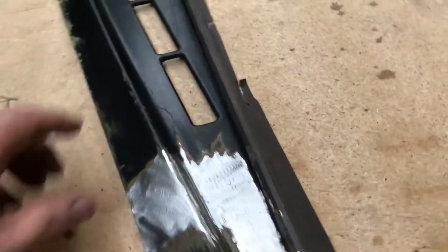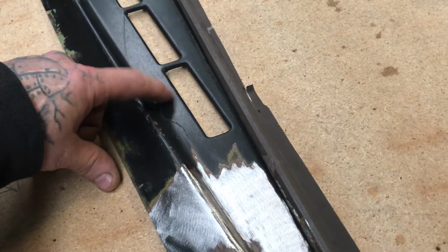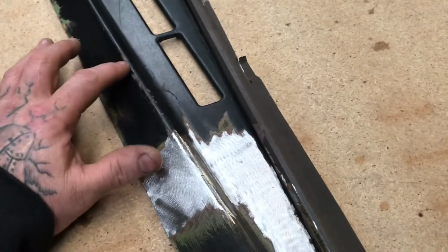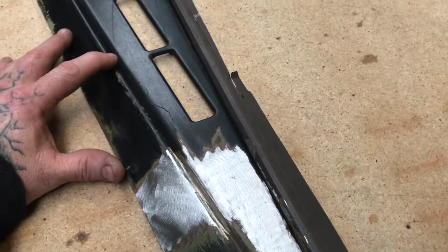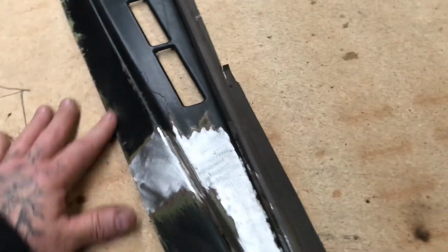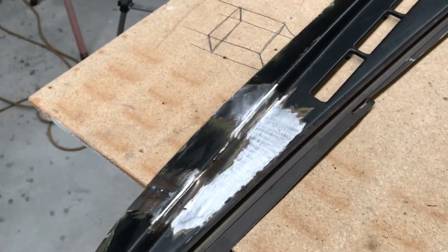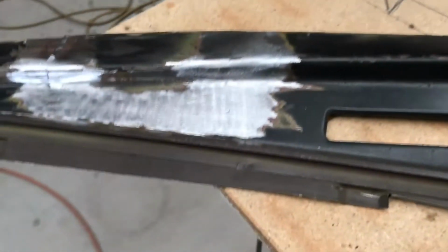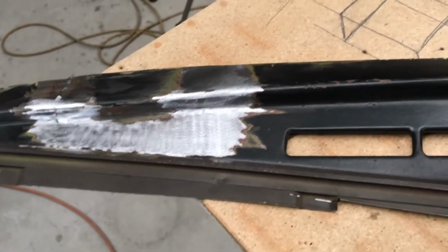There's no particular trick other than, wherever the weld is, if this was the top of your weld and you start seeing that the grinder's taking material off beside it, just readjust yourself so that you're in a nice comfortable position to aim the grinder right where it needs to be. Because being comfortable, same with welding, is important, and it does make a big difference to the outcome. If you're in such a horrible position that you can't wait to get out of there, you're going to rush it, and obviously that's not the way to do things.